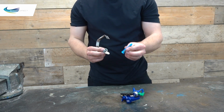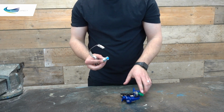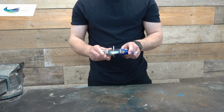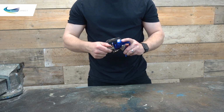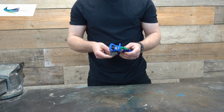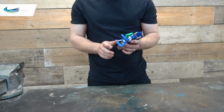If you want to use the machine for emulsion works, like spraying walls and ceilings, you'll want to swap that out for a 60 mesh filter and get yourself a larger tip like a LP517. I'll put a link in the description below to where you can find these. Also, make sure you get yourself the smaller filter, specifically designed for the compact gun, because if you get a larger one, it's not going to fit in there.